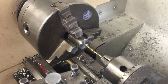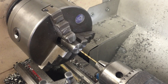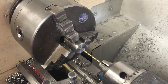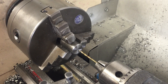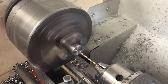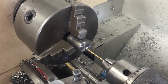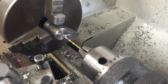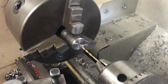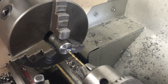I'm using my lathe to build a quick release for my tailstock and I need to drill an off-center hole. As you can see I have a three-jaw chuck. With a four-jaw chuck it's quite easy to make an off-center hole — you just adjust it so that it's off-center. But it's also quite easy with a three-jaw chuck.